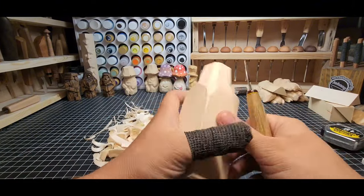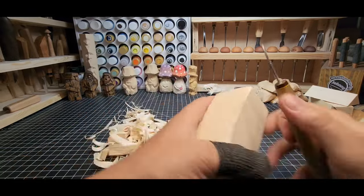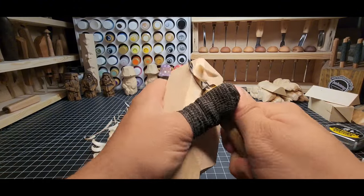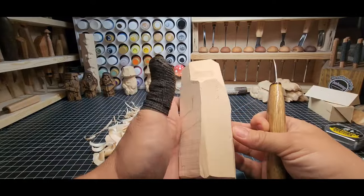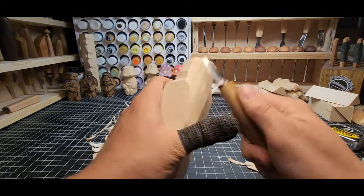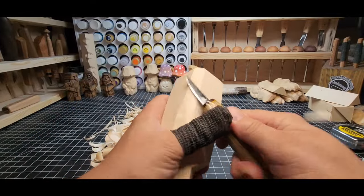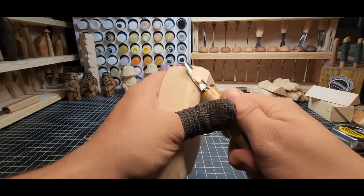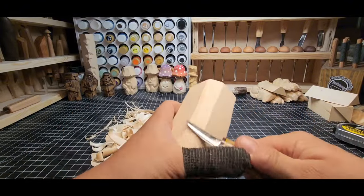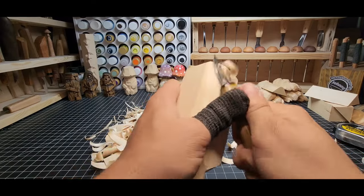Working on the back of the head here, we're just taking out a lot of that extra wood. There's a whole lot we can get rid of — we're not getting rid of as much in the front because we've got to have room for the axe, but in the back take out this big hard corner and soften this out immensely. When you're working against the grain going upward on this carving, you can split the wood a little bit and kind of use that to your advantage to get large chunks of wood out, then smooth it over afterwards. These rough cuts are just hogging a lot of wood out — it's not about detail work at this point, it's just about getting rid of the wood and getting a rough shape.